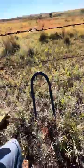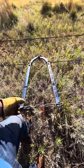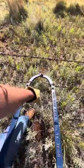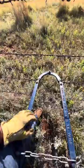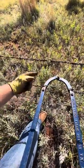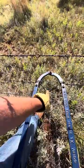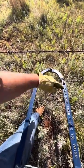Using this Texas fence fixer here. What you do is clamp it on each side, squeeze it together — it'll make this V here, taking the slack out of your fence. You get a piece of scrap, roll it around this way on each side, so you got a straight piece here. Then you take a pair of pliers or a screwdriver and twist this around.